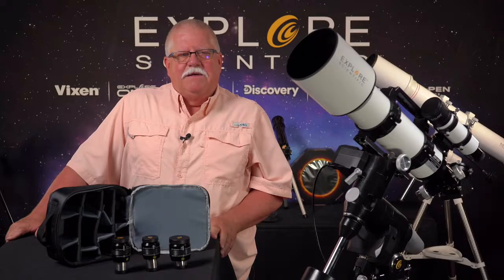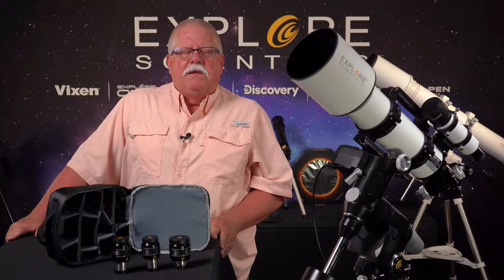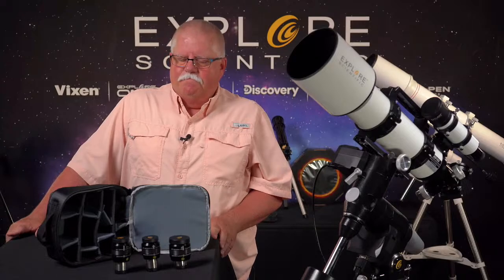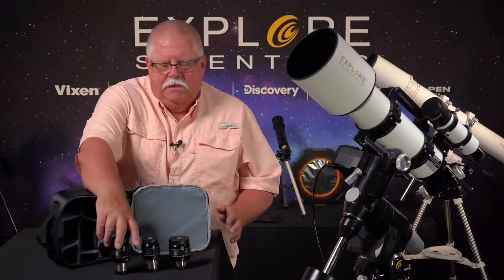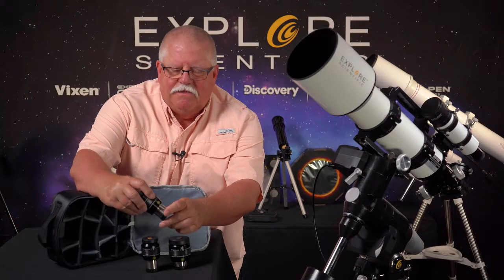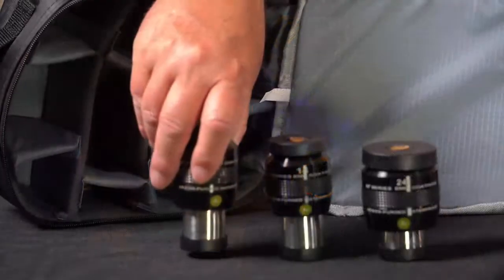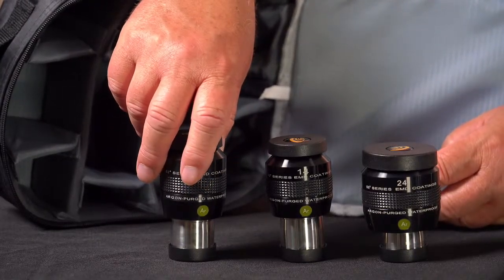So anyway, moving on, the eyepieces are submerged in the argon, and that causes all the air to come out. The air takes the moisture with it. And therefore, they put a plug in under that little AR symbol right there. We have a machine here that does this. We have a small tank that does it. It's not a manufacturing scale tank.